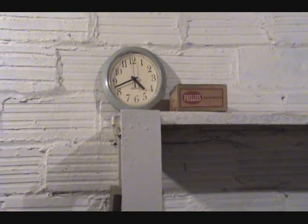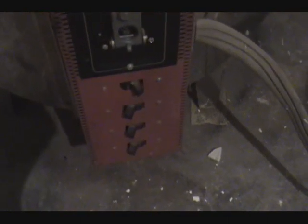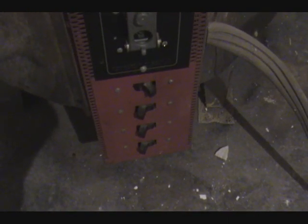We're back — it's roughly a quarter till five. We're going to come down to the kiln and flip switch number three to the on position. So now we have three to the left — because on this kiln left is on, right is off — we've got three switches thrown and one still off. We're going to wait another hour and throw the final switch.